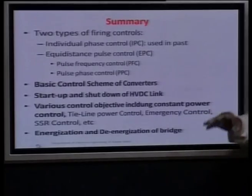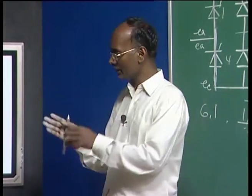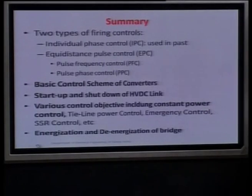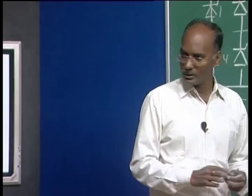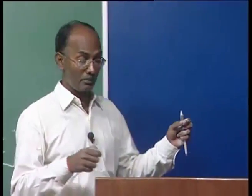We saw the basic control schemes from both the rectifier and the inverter side as well, and we saw CC, CEA, all the characteristics with the power and VDCOL limiters, various blocks. Then I discussed the startup and shutdown of the HVDC link. How we can start once you are energizing the complete link, rather than the bridge, I am talking about here. So, how we start and then how we can shut down